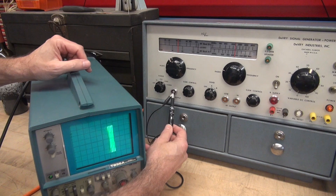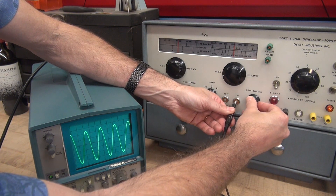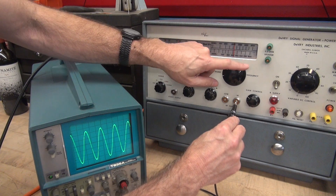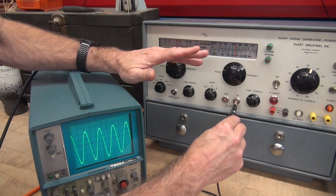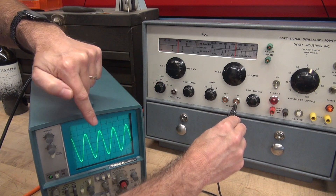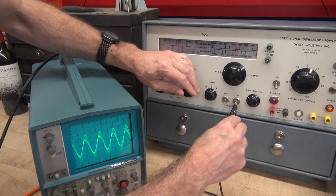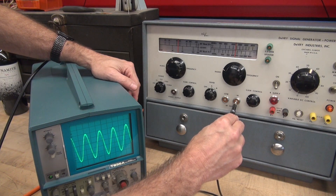Now I'm on the RF output — it's your gain control, which will obviously change the amplitude. I'm at band A, which is 250 to 600 kilocycles. You can vary that. If you're troubleshooting a radio and want an audio tone, you flip on the audio — now you're actually modulating that carrier and you would hear that on your radio. Very cool function. I noticed it does not seem to vary with this amplitude control; it's just giving it a percentage of modulation. I'm not sure if that can be controlled, but we'll take a listen when I hook up a radio.